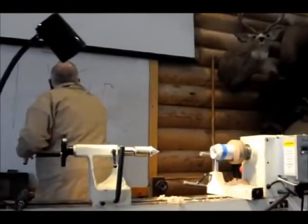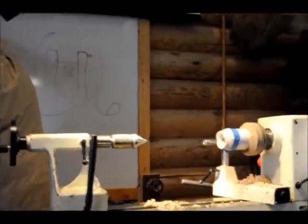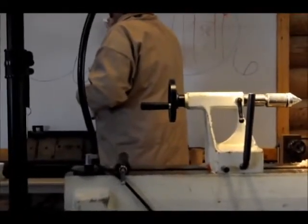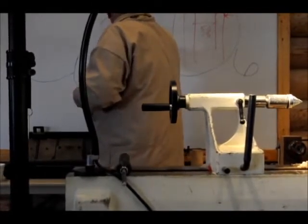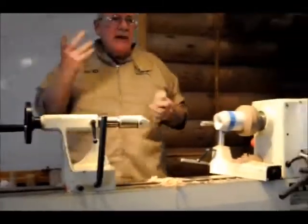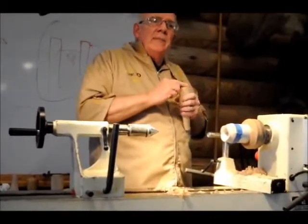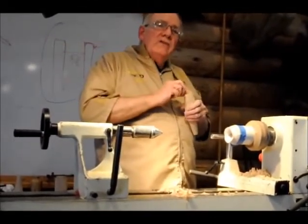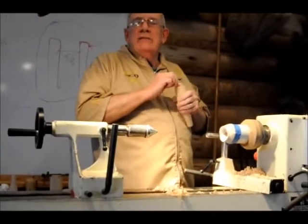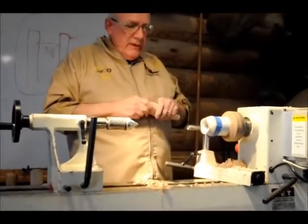There's a tool, one of the fancy carbide tools, and I'll show you a picture of it. They're gold in color. Somebody's come up with the name. You've got the shaft here, and the top with the curve on it, and your carbide up there. I really like those because I can take that Dremel now, and it's curved the right way. I'm not putting a square surface in there, and so I can feel it with my fingers so that I don't have any bump in there. And then from there, I can finish sand it with 220 and a couple other grits.